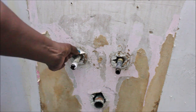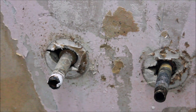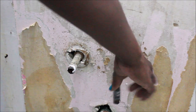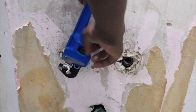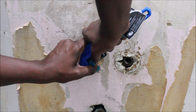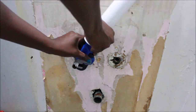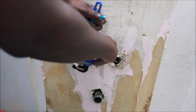You can see how old this is — we live in an old house. Nobody knew because who tears down stuff and looks at the pipes in the wall? I did my faucet in the kitchen a long time ago, but this was kind of complicated. I did not put WD-40 on the second pipe. The one already off was the one leaking, but since I got one off and it looked nasty, I'm getting both off and starting fresh with clean pipe nipples.